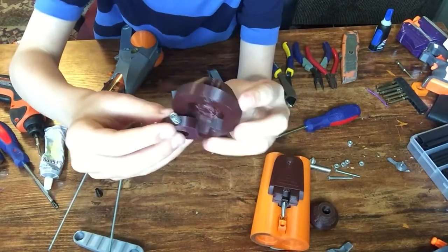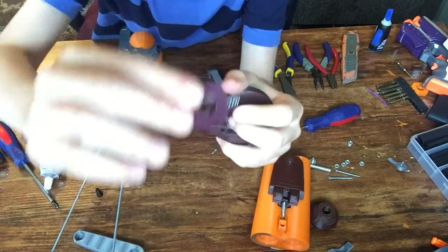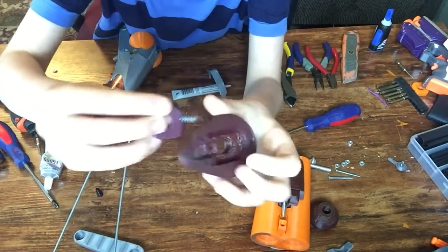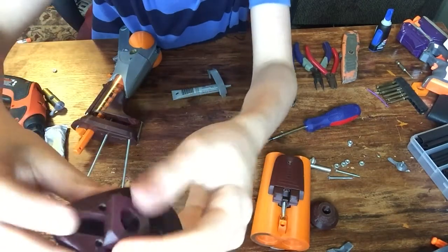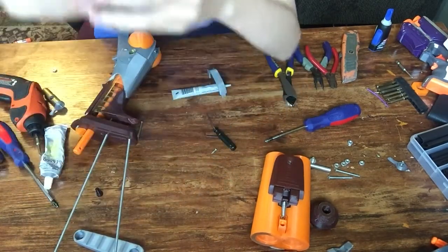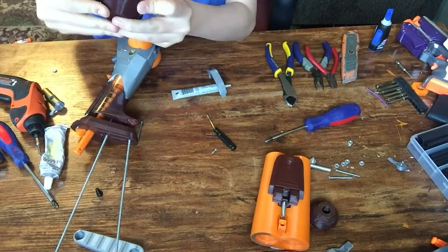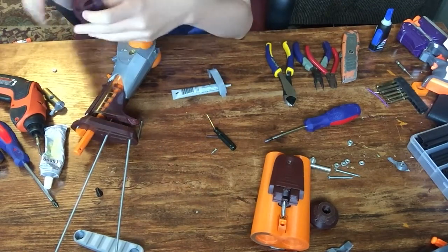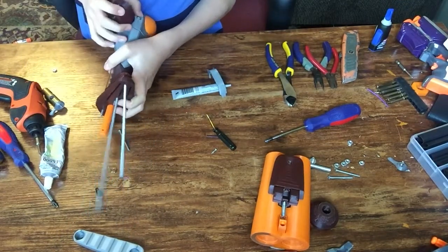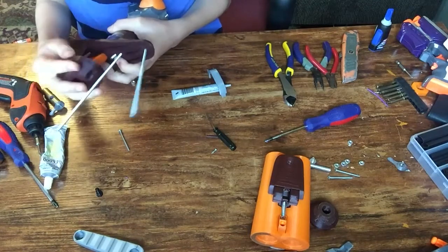For the catch assembly, it's very important which direction you orientate this. So place your spring in the catch. Insert it like this, so that the curved side is facing the hole. This may seem counterintuitive, but it makes it work with the trigger, because that's how it's designed. It looks kind of weird, but it works. Then you close this fully, which takes some strength, since you have to fight the spring. There's some pre-compression.